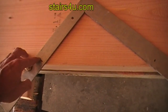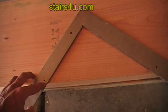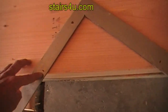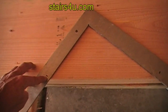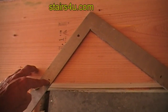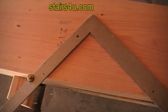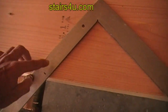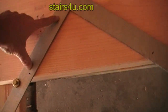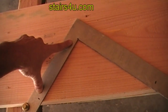The set of stairs I'm building only has four risers, but if you're off just a little bit — say a sixteenth of an inch in your riser measurement — and you have 14 risers, you're going to be off seven eighths of an inch total. So make sure you get these measurements right on. A sixteenth of an inch might not sound like a big deal and might not even be noticeable, but...